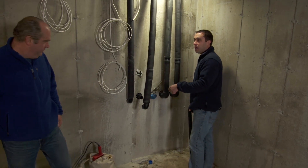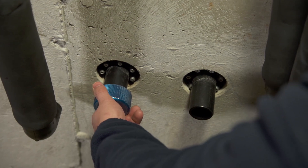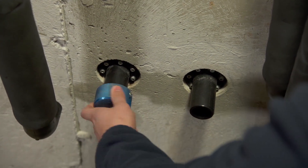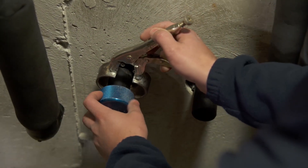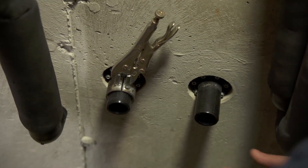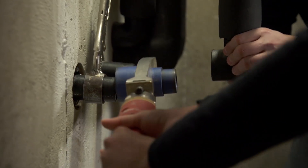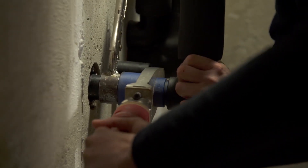I'm going to have Melanie come over and give me a hand doing this fusion. First, we prep the pipe using the transfer tool. That cleans the front edge and gives us the correct spacing. A cold ring keeps the pipe from melting too far from the connection. We use a special iron to heat the elbow coupling in the pipe. Twenty seconds later, we put the fitting on the pipe.